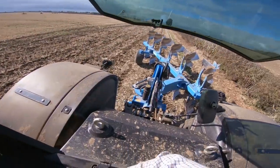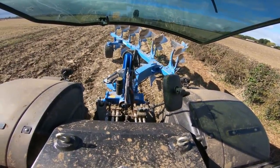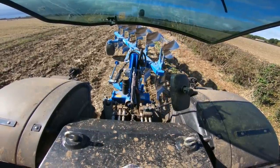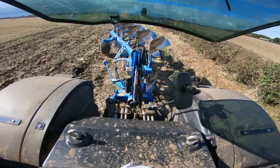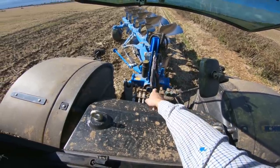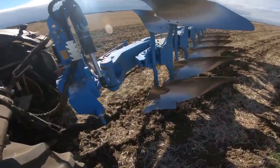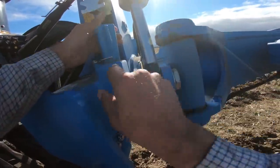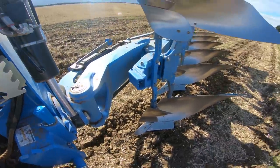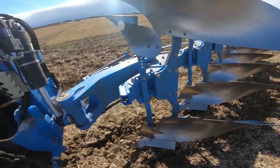So if I just lift it up a little bit, you'll see now with this green spool - that's fully in the on-land position. And bring it over like that, and there you go - it's set for working in the furrow. You then have to adjust the two depth stops here, which you merely turn that top turnbuckle and it raises that stop up or down. And then you'd lower them down. So obviously when you're in the furrow, tractor is at an angle, it allows the plough to stay level. So that's the two things that you'd need to do.